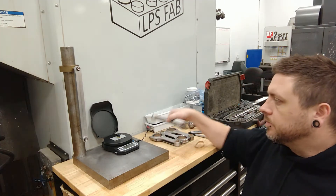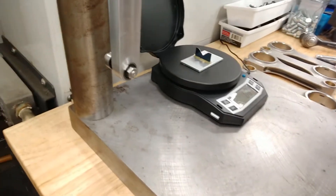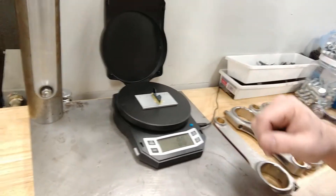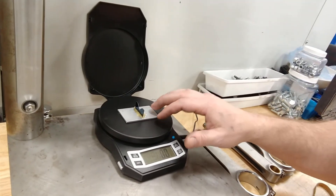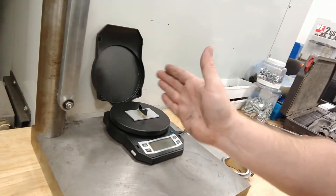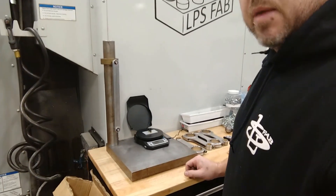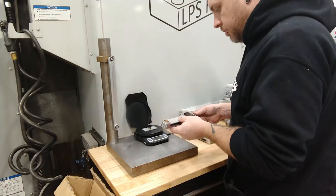I already showed this in another quick video, but the little setup I have is made from shim stock — I cut a little V into it, deburred it really well, and glued it to a plate. The plate has double sticky tape on the bottom edges so it can't move on the scale, and the scale has rubber feet so it can't move either. That way it'll always maintain the same location and won't skew my weight measurements. You guys can make something or buy something as far as a jig for balancing, but the setup is up to you to make it accurate. I'm going to go ahead and start going through these rods and writing some numbers on them.